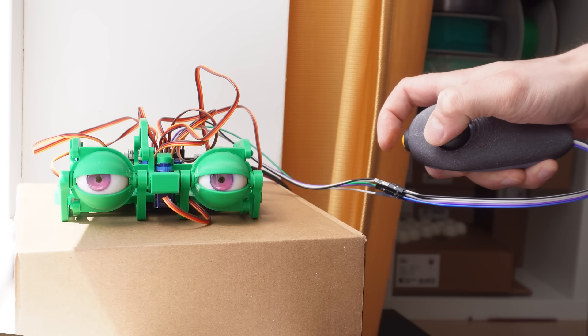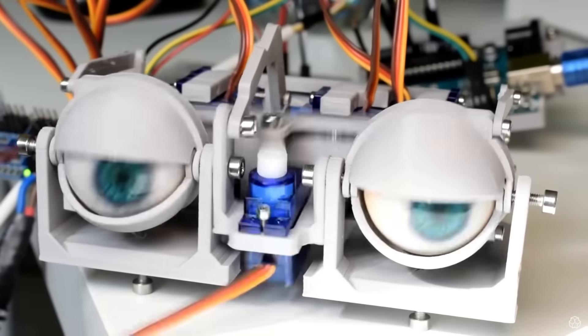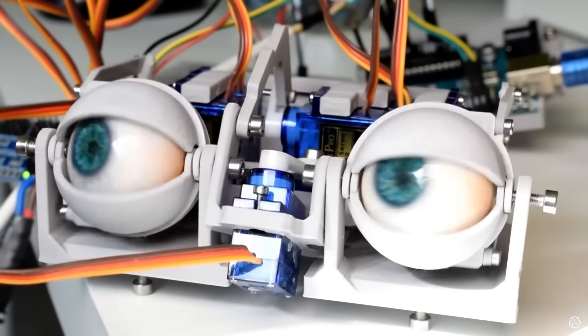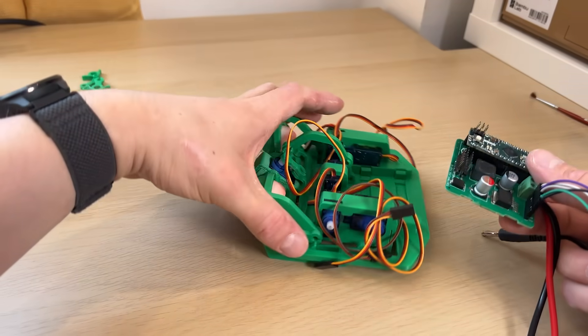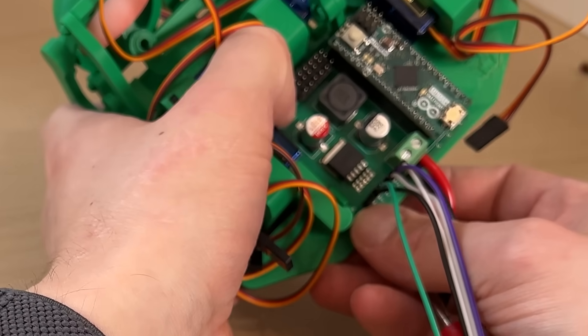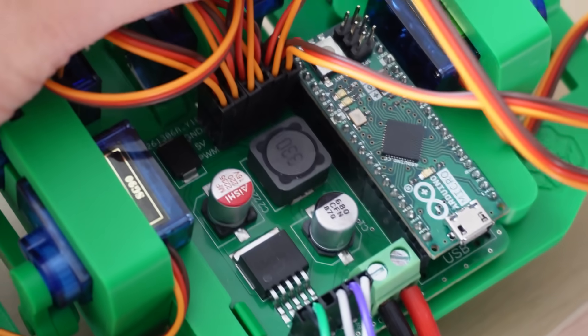Welcome Cogs! As a way to make the design more accessible by cutting down on the part count, and as a kind of engineering challenge to myself, I took one of my original i-mechanism designs and took out all 45 screws and replaced every single one with snap-fit pins, joints, and latches. I also designed a new circuit board with JLCPCB, which conveniently snaps into place and powers the Arduino and servos simultaneously with a single voltage input, removing the need for the old servo driver board and finally ridding the design of breadboards and jumper cables.